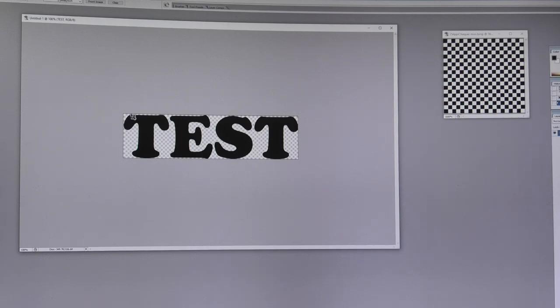You would either engrave an image from a bitmap or you would engrave an image from an outline. Either way round, you would be scanning backwards and forwards across that image and producing this text with the beam switching on, off, on, off. But all the time it's on, it's continuously on, producing smoke and fumes and burn, putting energy into the wood. So as it comes across different types of wood, you've got the same amount of energy going in, but the effect on the wood is different.